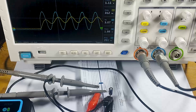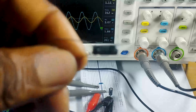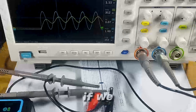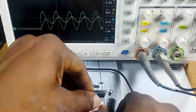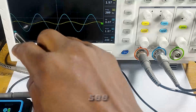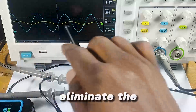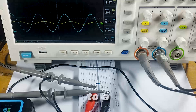If we use a larger capacitor — let's try a 2.2µF — we can take the 1µF out and run it again. You can see we have a smoother wave than before. The 2.2µF helps eliminate the fluctuations better. We have a signal very close to a perfect DC signal.